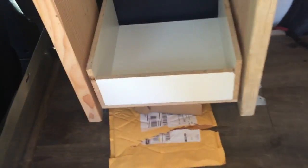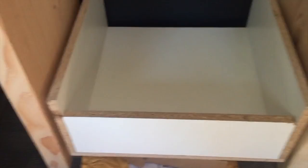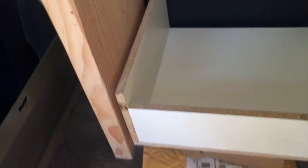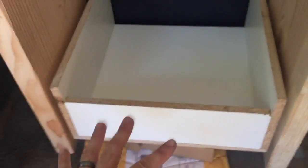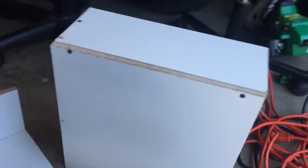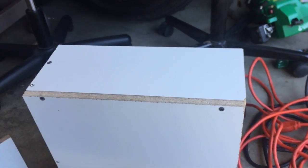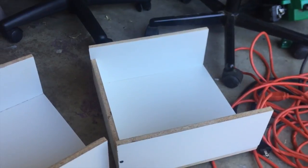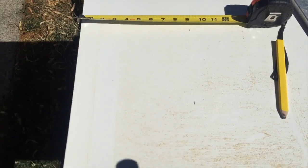Right now I'm installing drawers, just framing them out. I've got the sides and the little front support bar, and I'm going to add a back piece and lastly a front piece that goes all the way across - there are going to be three drawers. I started with 14 by 14 square pieces, cut sides about five and a half inches tall, and drilled two holes through the bottom. You don't need a ton of screws as long as they're tight and secure. The lighter the drawers the better - once they're all glued together it's pretty secure, kind of like IKEA furniture.